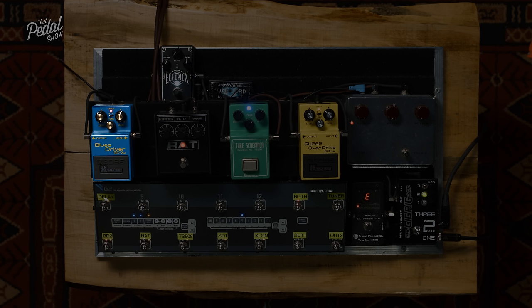Diodes are basically a semiconductor, and they will allow current to travel in one direction, and they have a thing called a forward voltage. What that means is that if you imagine we have our waveform, the forward voltage will only let the voltage travel up a certain way before it gets clipped off, okay? So if we have a look at, because we've got the Klon on,